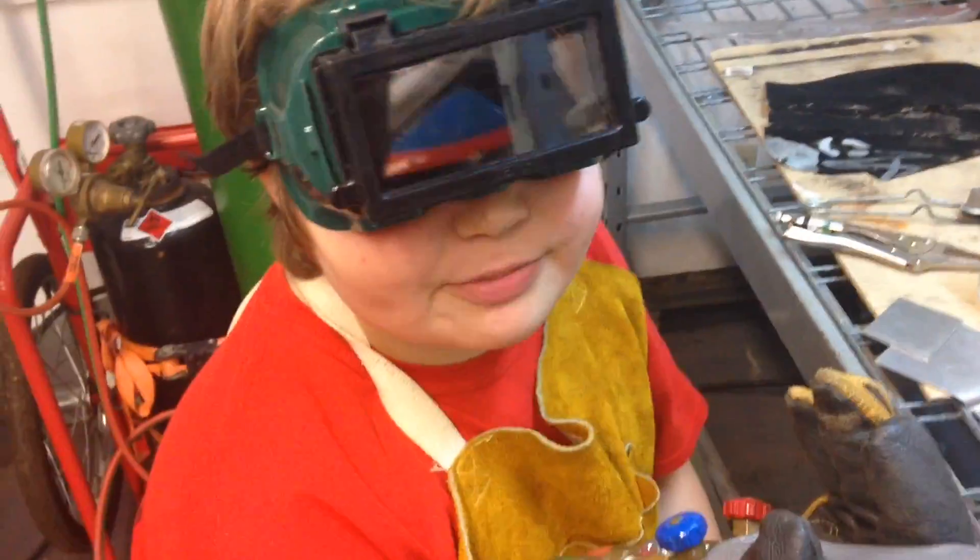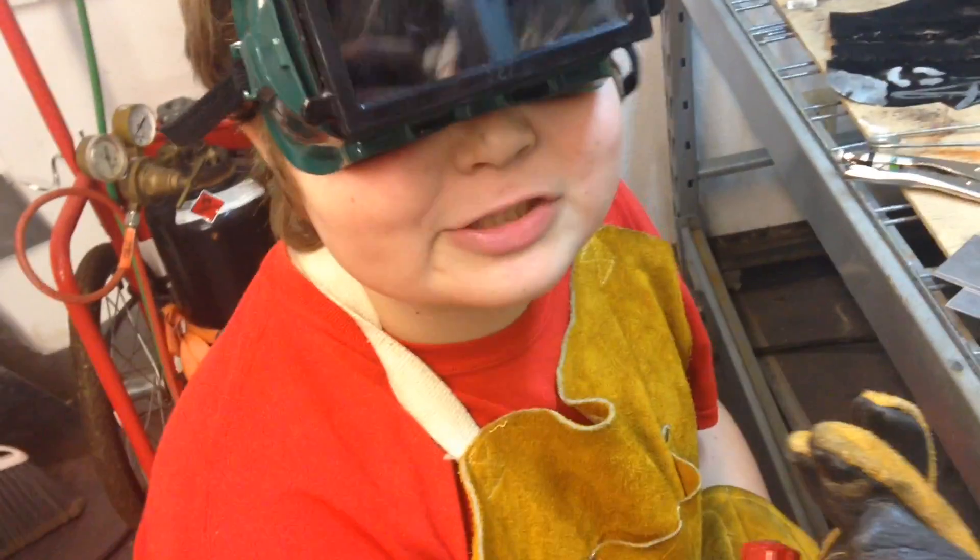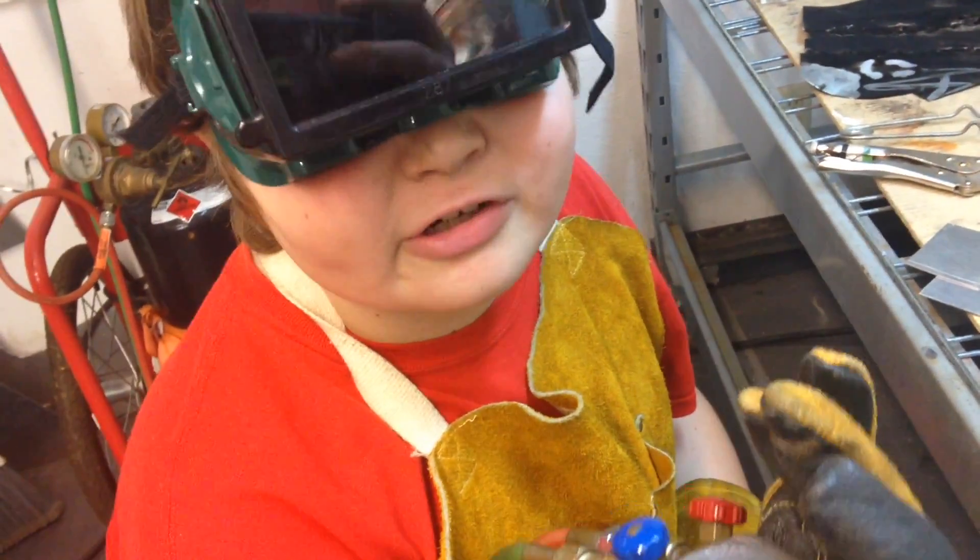I do the swirl — we're able to move it. We're able to move the metal around. It's kind of fun because you play with heat and you play with metal. Since we didn't put any flux on it, it took longer to go through the oxide layer. Now we're going to put some flux on it so it breaks through the oxide layer and makes it easier to get it hotter quicker.